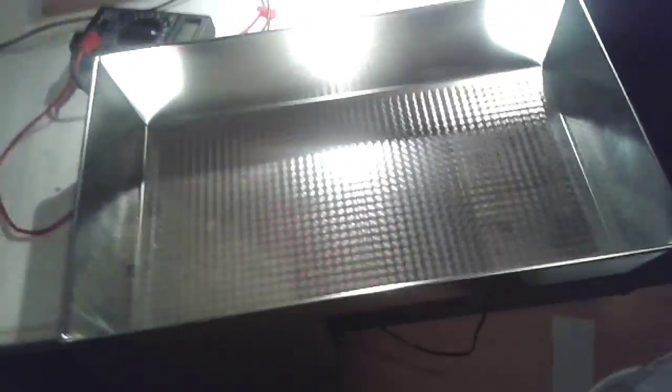Let me show you some examples. For a stereo chassis — if you're going to build your typical stereo amp — you can actually use, and I know it's a little scary looking, here's a big one. This is a cake pan. You can find these cheap pressed and folded plate cake pans. This one was under two dollars — 1 euro 50. It's perfect. It's actually thin enough that you can cut it with tin snips or a drill, so you can have your resistors, your rheostats coming out, your tubes and stuff coming out. It's firm enough to hold them but thin enough that you can cut through it without any big special tools.